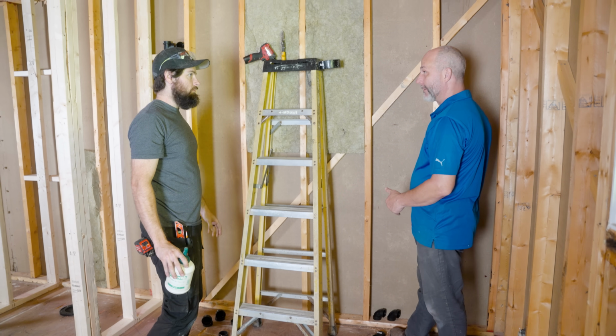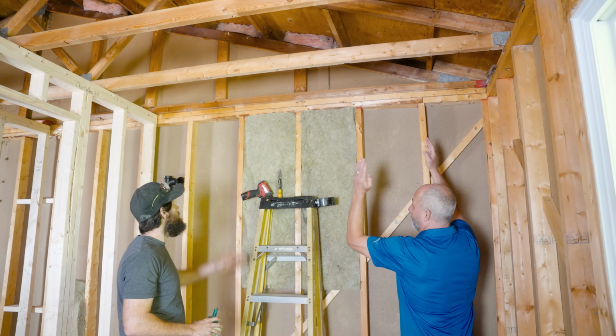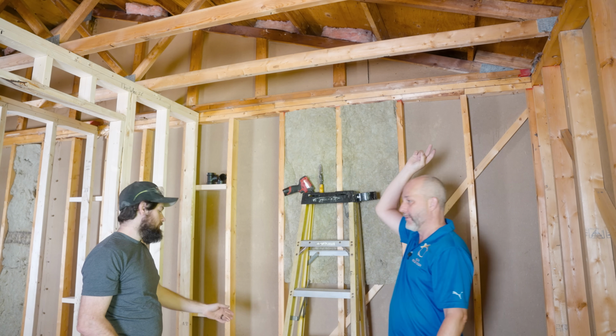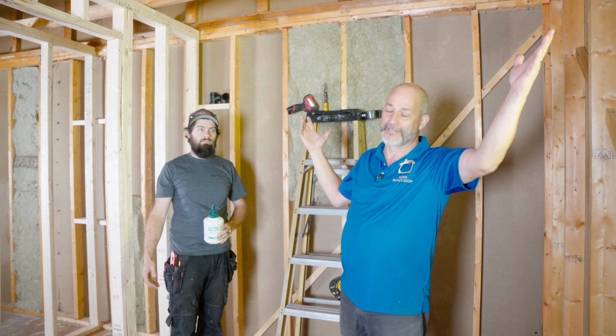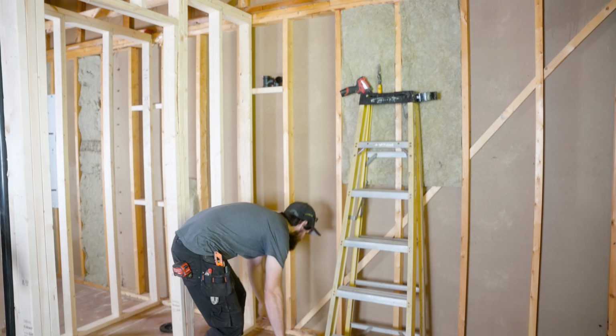For a vent. Exactly. And then we can drywall, and then once the cabinet's in, then it gets tied together. And this would be considered a continuous vent. Correct. Goes up through, drilling through the plates, both sinks individually, tying together in the attic. Yeah. And then we pick up every other room along the way, heading out to our roof penetration. Yes. Life is simple. Get started. Beautiful.